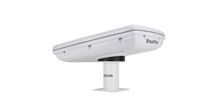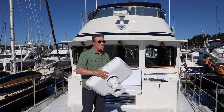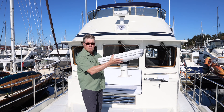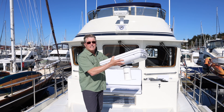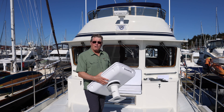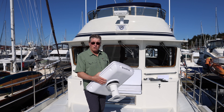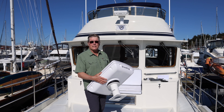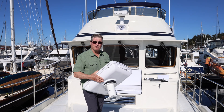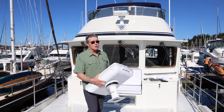There's a wedge in between as well. The wedge allows us to rotate this. Per the instructions from Starlink, you can go ahead and optimize the view of the satellites in the sky with the built-in angle they provide on that little kickstand. We built in the 10-degree angle. The other important thing about the angle we've experienced: you need the water runoff. If you have a flat Starlink dish and you don't have an angle on it, water can accumulate, and if water accumulates, you get signal degradation. We never experienced signal degradation when we had the water runoff. That was one of the things we converted the previous year — we added the wedge from our experience cruising around.